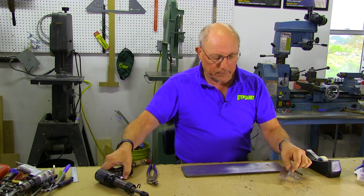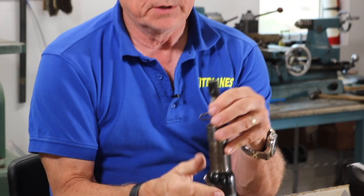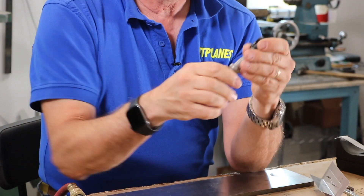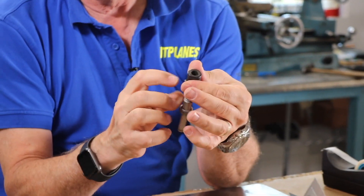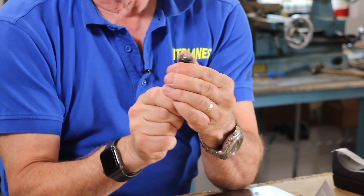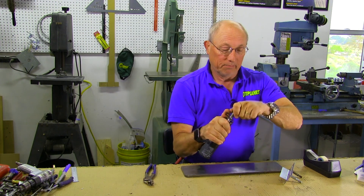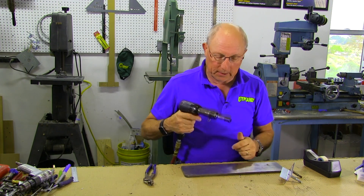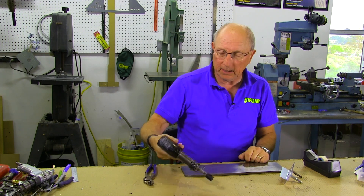There's not a whole lot of complicated nature — it actually makes kind of sense. You need a back riveting set in your gun, and this is a little spring-loaded doohickey. It's basically a solid rivet set with a little capture device, which is spring-loaded around it. You can back rivet with a standard bar or a standard set if you're good enough, but this really helps you to capture the tail better.